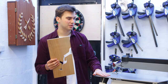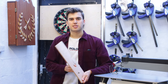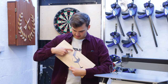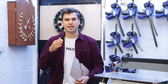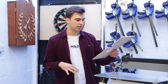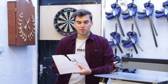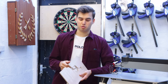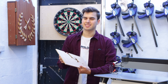That was my first cut with this scroll saw — I found it really intuitive and really easy to control. I'm really happy with the result for my first cutout. Some things I found really impressive: with such a thin blade you'd think it's difficult getting a straight line, but as you can see with the neck of the wine bottle, I had no issues there. And especially with these sweeping curves — when you've got a very thin blade you can imagine getting quite a wobbly line — but it was just so smooth and you have complete control. Another thing I really like is the finish it gave. It sort of burnished the edge, and it feels like the type of edge you'd get off a hand plane. So you definitely don't need any sanding, which is perfect for scroll sawing because a lot of the time you're cutting out very small details that you can't get sandpaper into.